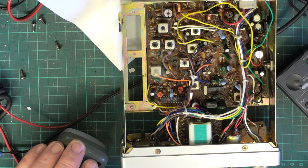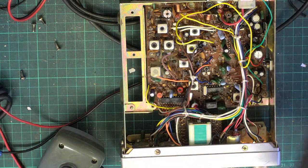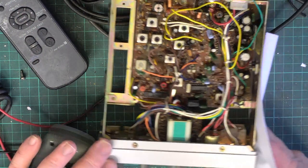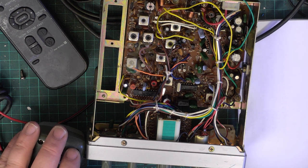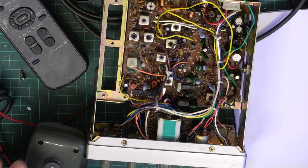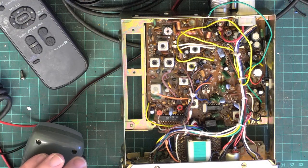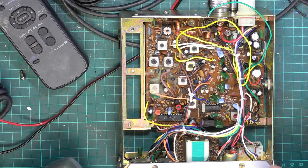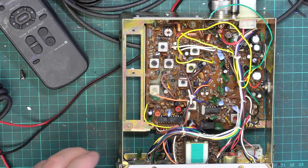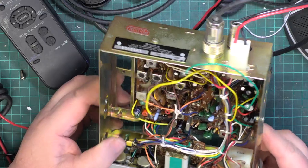I would say we have. So we lined this yesterday and we got, didn't I write any of this down? So it's 0.55 microvolts for 12 dB SINAD, which is what you expect. So we'll put S9 on the meter. Take picture in... Oh, I've not had picture in picture on. That's my fault this time. So it's reading S9, and on this version it isn't adjustable.